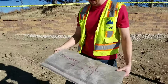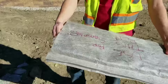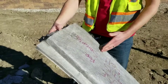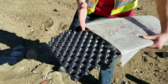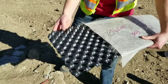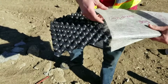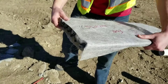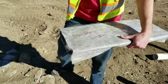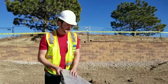You may ask about junctions. At a T-riser junction or any 90 or 45-degree junction, you would cut the felt paper back, remove a piece of the soil gas mat plastic material, and lay it back down interlocking them like puzzle pieces. Then put the felt material back over the top, duct tape the seams so no aggregate gets in — and you've made a junction. That happens at every single corner here. They're buried below the barrier at this point, otherwise I'd show you.